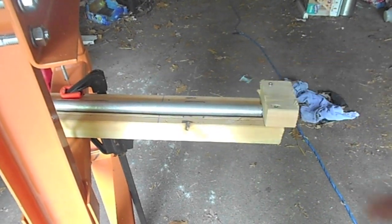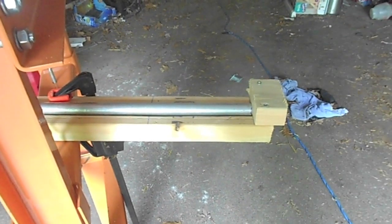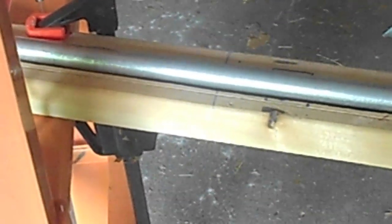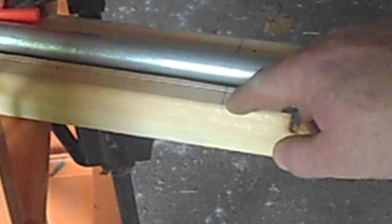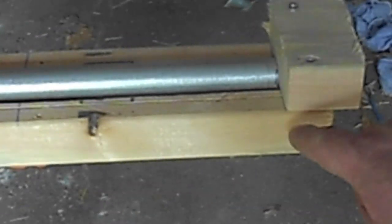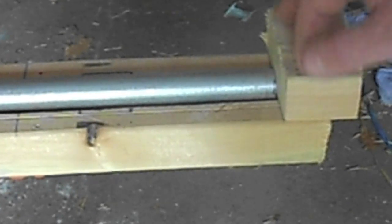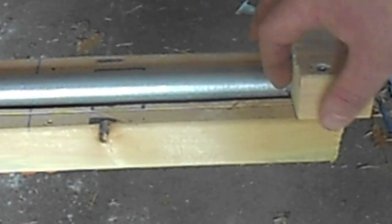Here's my drilling jig, which is also my second-end flattening jig. Basically it's just a 2x4 — an 8-foot 2x4 that I cut off at about five and a half inches. Then I marked a line at 4.7 and 5.3, cut off a block of wood, and nailed it.